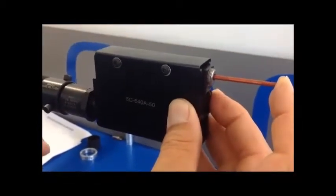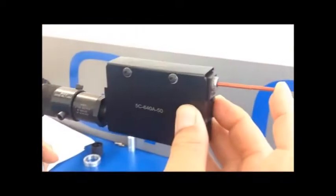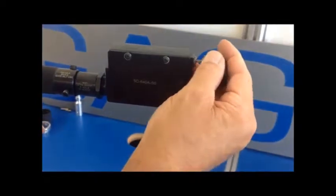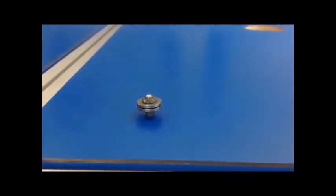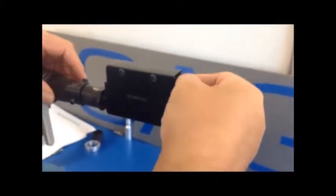If your nose assembly is not adjusted correctly using this gauge, you are going to get a bad installation, which we are going to show you right now. As you see, both the stem and the ring appear to be higher than the face of the rivet — much higher. So we need to adjust the inner anvil in order to properly install the rivet within specification.